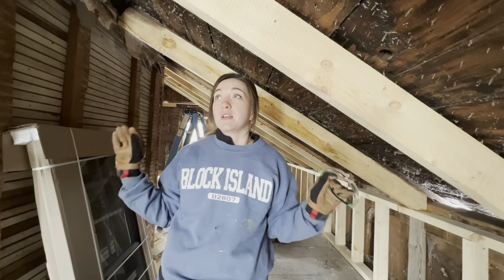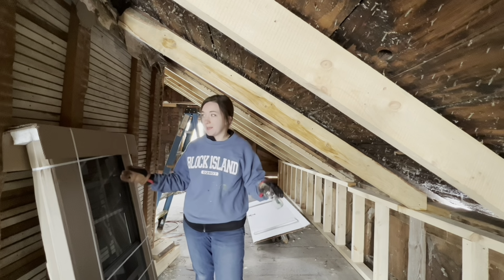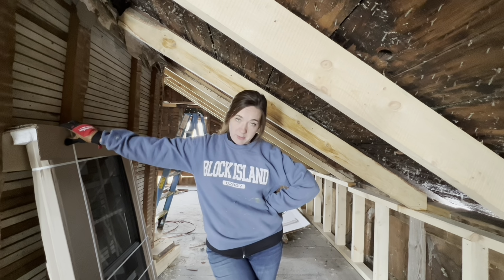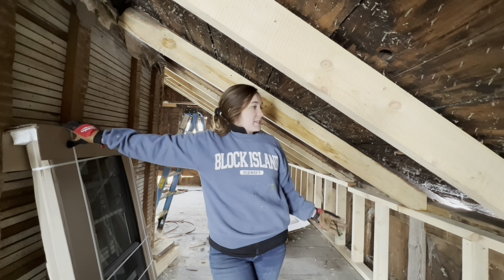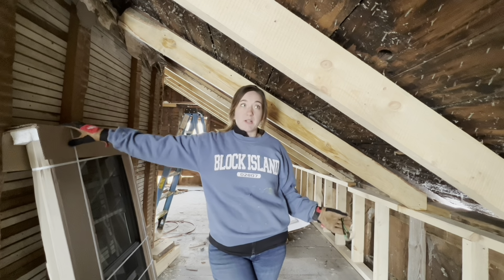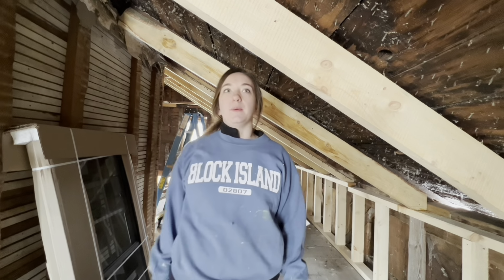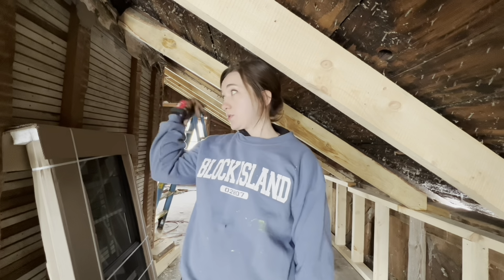Let me show you. Okay, the biggest suggestion that I get in the comments over the entirety of my YouTube channel has been, are you going to put in a bathroom upstairs? Or why aren't you putting a bathroom upstairs? I know I've talked about this some before in a recent video, but the reason that I kept saying no, I'm not gonna put a bathroom upstairs is because of the ceiling. It's just straight up too short. When I'm standing here, it is hitting my head, but it's gonna go even an inch-ish lower than this because of the sheetrock and the strapping.